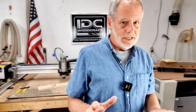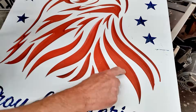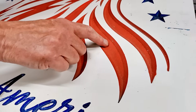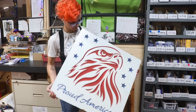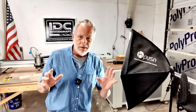I want to show you why this makes a difference. I've got a project over here — this big eagle. It's a project I made a long time ago, and it's all done with V-carving. So we have V-shapes just like these swirls, but you see how it only goes to a certain depth. For a carve that's this big, if we were to do a full depth V-carve, it would cut all the way through the material, where using flat depth gives you a shallow cut. That imbalance will make your whole project look bad. So we're going to get into the Vectric software and I'll show you how to work with flat depth to make your CNC projects look better.